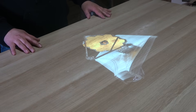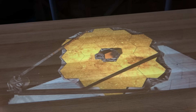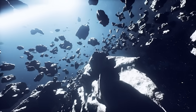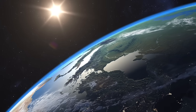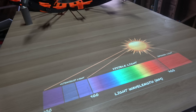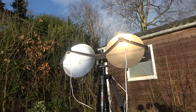The first question I had before even starting was: since we're using the James Webb telescope as inspiration for our solar death ray, should we also use the same color mirrors? The James Webb telescope uses gold mirrors, and that's for a good reason — gold is excellent at reflecting infrared light, which is essential for observing objects deep in outer space. But gold is not the most optimal material for capturing heat from the sun down here on Earth, because gold, unlike silver, doesn't reflect visible light well, and visible light is crucial for concentrating sunlight to generate heat.